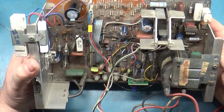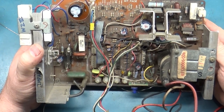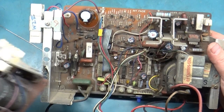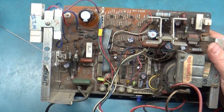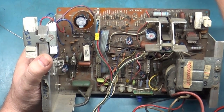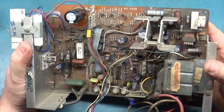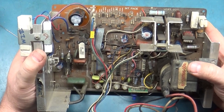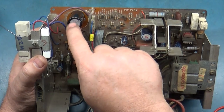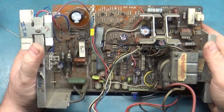But I'm half tempted to try it again. And if it takes out the voltage regulator, I've got the one from here that I can slave in for a third try after changing the flyback out. And I can always order. I mean, I need to order more anyway because I have my last one. But I'm tempted to try it again after fixing those two caps with the leg being out of circuit and this leaky filter cap.